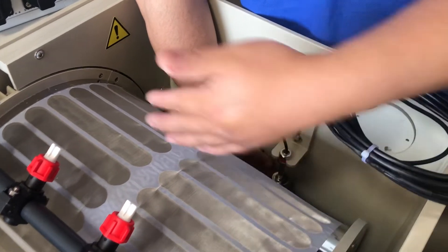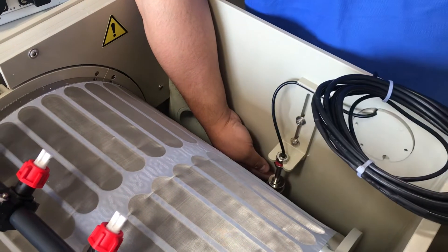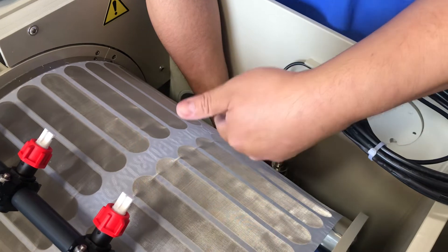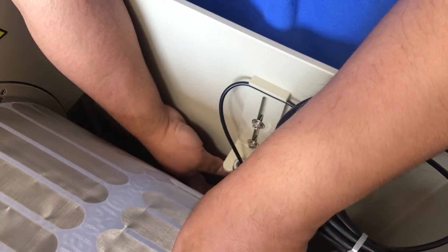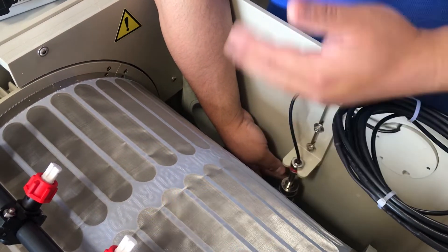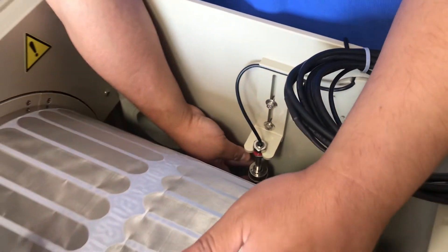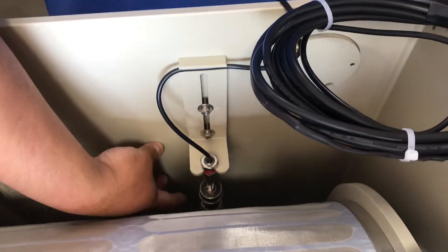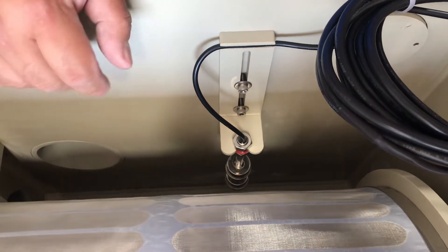Once the screen is sprayed and cleaned, the water will come back up and pull the float back up again. It's an up-and-down motion that turns the cleaning cycle on and off. But if something is wrong — if the pump isn't returning water and the water continues to go down — the second float will also go down. When the second float goes down, it will shut down the motor, the spray pump, and the return pump. That is our safety feature: if anything is wrong, the unit shuts down rather than running 24/7, which would burn out the motor, booster pump, and return pump. You can move this sensor up and down to the level you need. The deeper the sensor, the less frequent the cleaning; the higher it is, the more frequent the cleaning. You just have to play around with it to get the right timing.